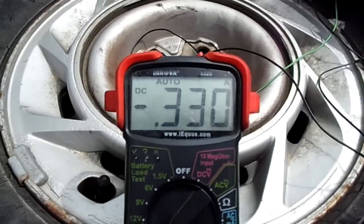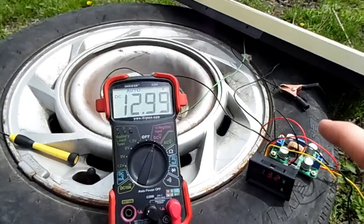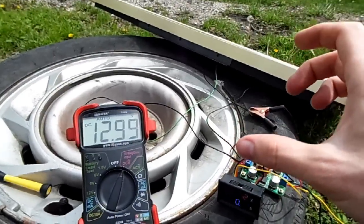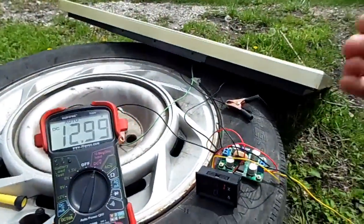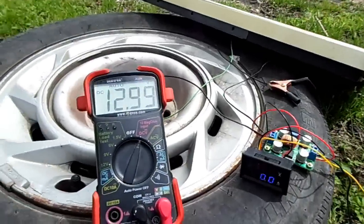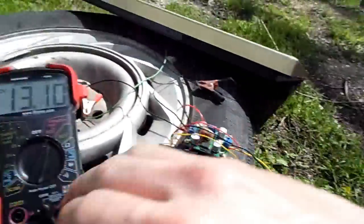It's peaking at about 350 milliamps of current — not too bad, and it is pretty cloudy today so on a fully clear day it'd give more power. What I might do is have this panel charging 4-volt lithium-ion cells at 5 volts, then set up a sensing circuit so whenever the lithium-ion cells get close to full it'll turn on and drain the power from the 4-volt lithium cells into the 12-volt battery. As it is right now I have to adjust the amperage setting depending on how bright it is outside.